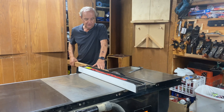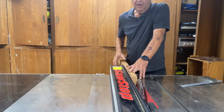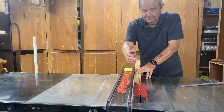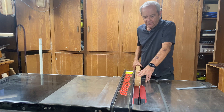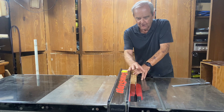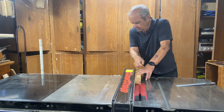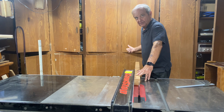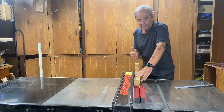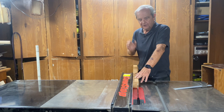But if you're doing a rip, you're pushing the wood against this blade, and the blade continues to go through it the whole length, so you have to keep pushing this thing. The danger is what's called kickback. Kickback means that the motion of the saw blade actually forces this piece of wood back this direction at high speed. That can happen, and you have to guard against it. It is the most important safety concern when you're using a table saw.